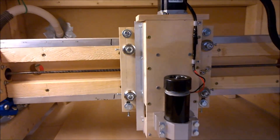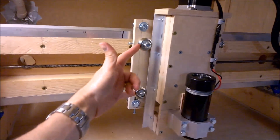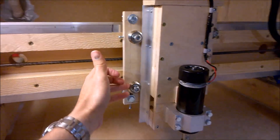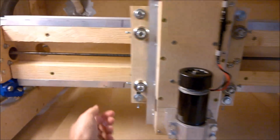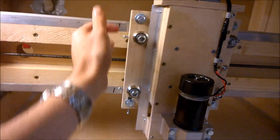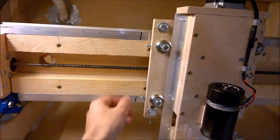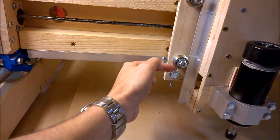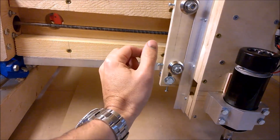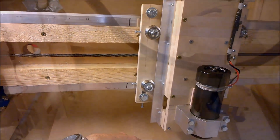It's pretty simple, and it's really, really rock solid. We've got eight of these V-groove bearings — four on the front that hold that box tight, and then one here, one here, one there, and one there. As far as getting this set up just right, I made a channel for these so they could slide up and down, and then tapped some screws so while it was being fine-tuned, we could tweak it just a little bit.